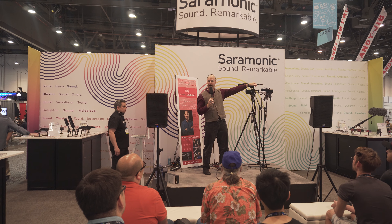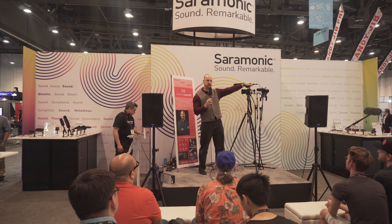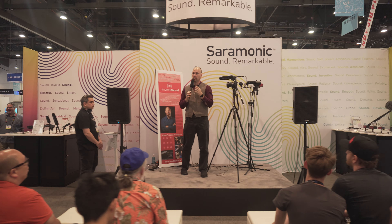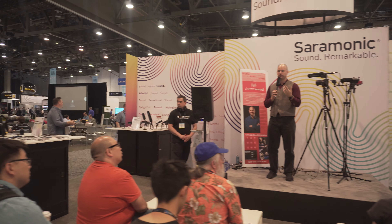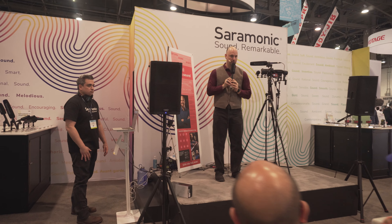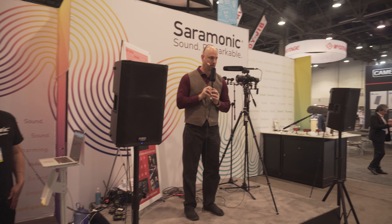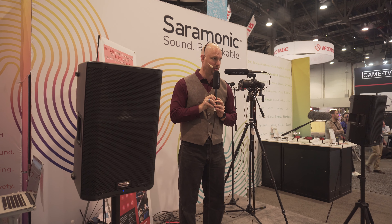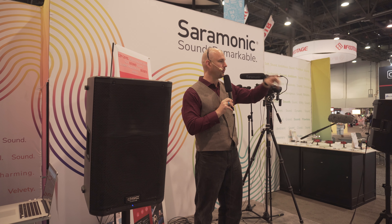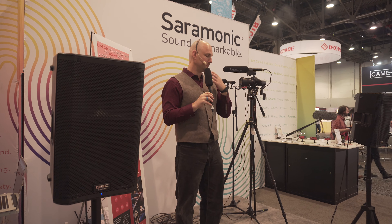So, input — how do we get a microphone into a camera? But once we get it in there, we have problems. For example, the sample rate, the bit depth, and the worst one is compression. Most cameras, the default setting is 16-bit. Sometimes it's 44.1k, which is like a great setting if it's 1982. And then it's some kind of compressed format — MP3, MP4, some crazy setting like this. And while it takes a small amount of space, the damage that it does to your audio is really intense.